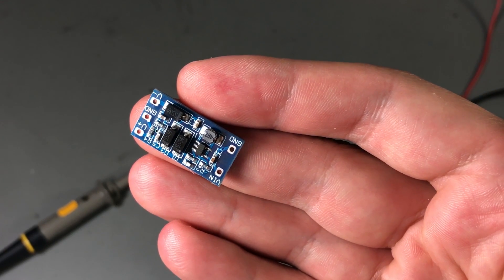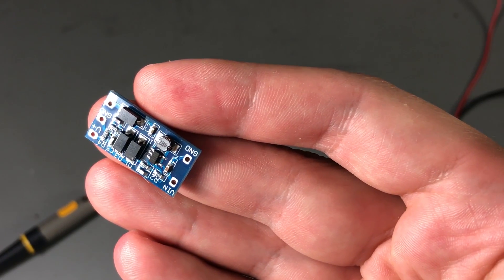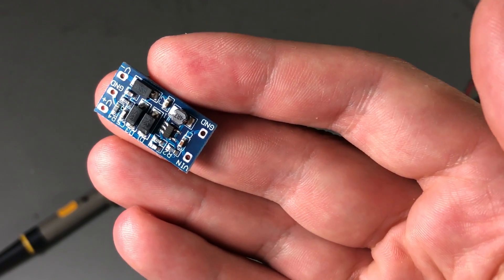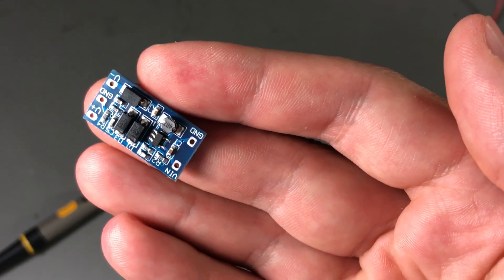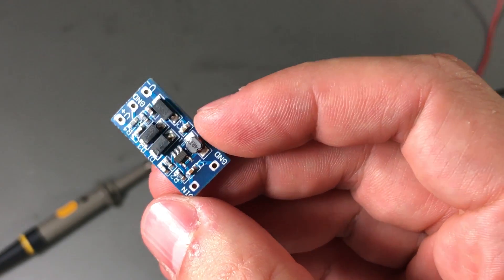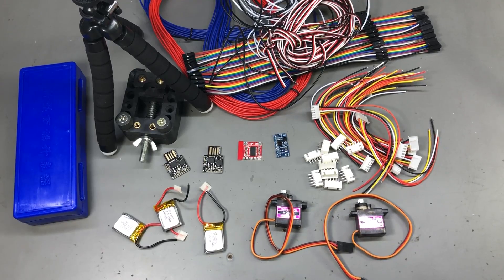I don't know what chip they're using as the DC-DC converter because the numbers have been erased, but it's a small SOT-235 device. The maximum output current is about 50 milliamps, so it's only good for powering op-amps and maybe DACs that need only a couple of milliamps. That was all for today — thank you for watching. Links for all the items shown will be in the description below. Hit the like button and let me know what you think in the comments. I'll see you next week.